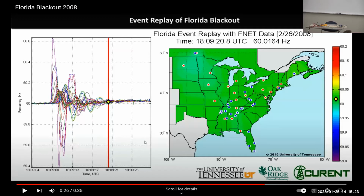Something has happened. When you have more frequency, what do you think? The generator is spinning faster. What happened with the kinetic energy? You have more kinetic energy. So at one moment, these are gaining energy from somewhere. Where is that coming from? From the other generators on this side, because they're reducing their frequency. So the failure is causing an exchange of kinetic energy over long distances, all over the country, from here to here and here. All these generators are exchanging energy. So you can see in the transmission lines flows of power going back and forth, right? That's the situation. That is called oscillations.